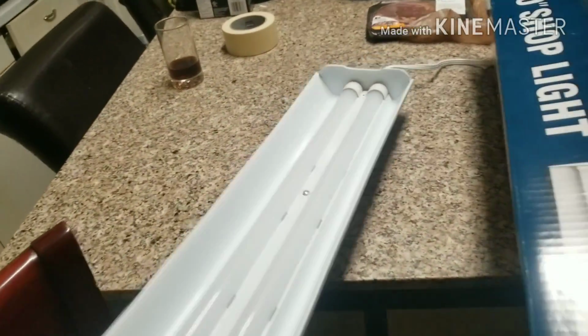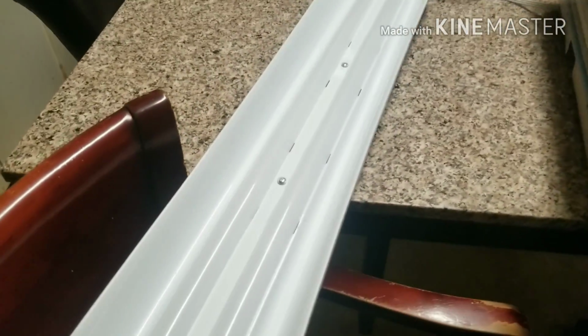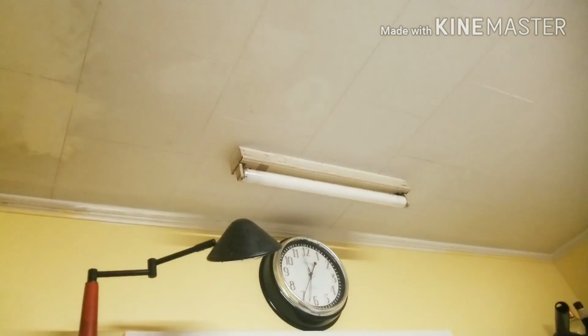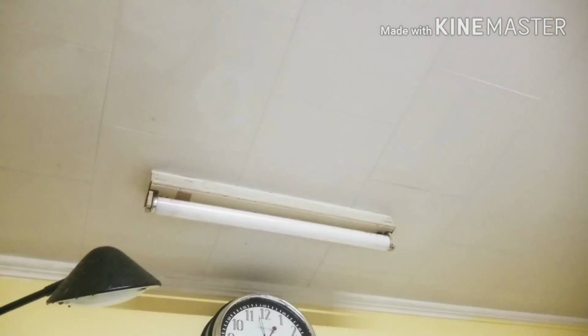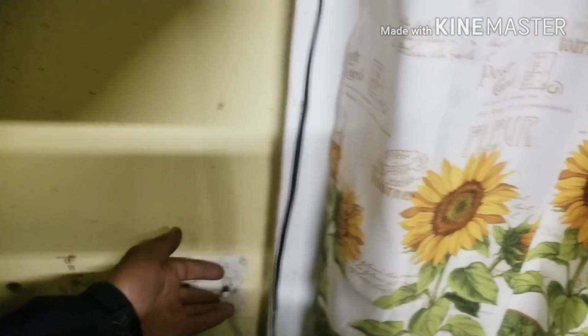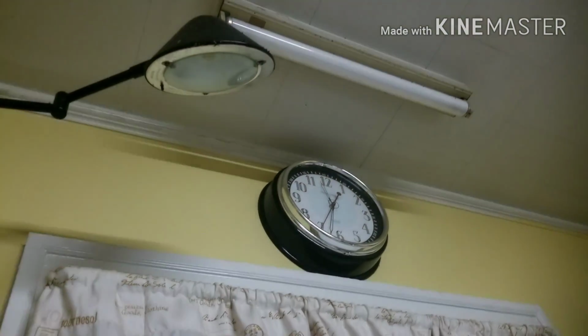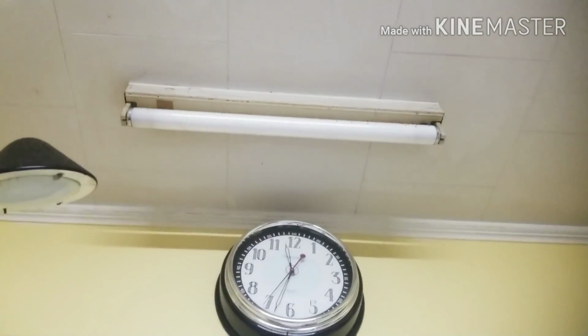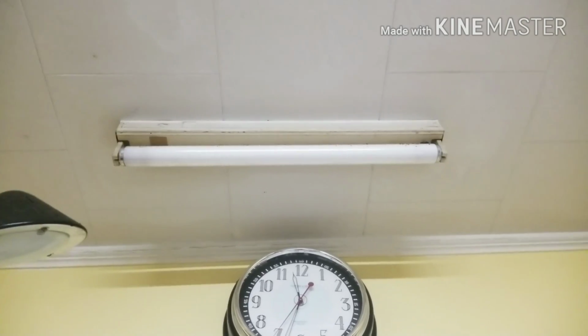It's basically two wires. Okay, so for this job, you'll need a screwdriver, flathead, Phillips head, and some wire cutters. And that's about it. Make sure you turn the electricity off before you start. In this case, this is a switched outlet here, so as long as we have that switch down, we shouldn't have any power there. First thing we're going to do is start by taking that old fixture away.